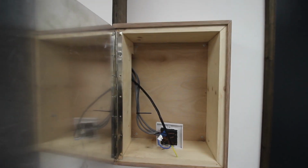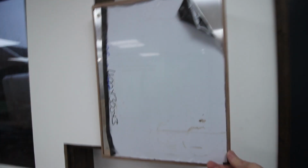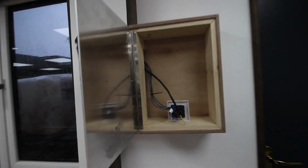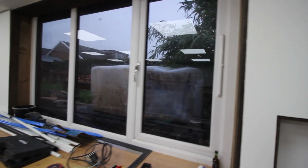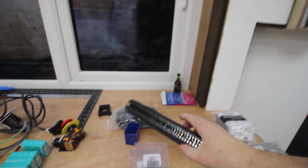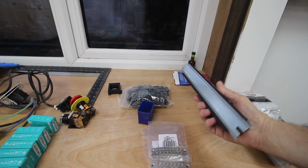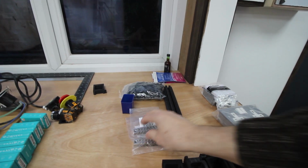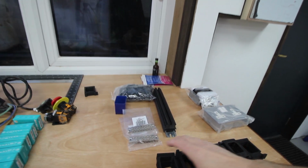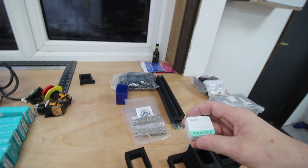Over here, this is the cabinet for the lighting and turning all sorts of bits and pieces off and on from in here. So that's underway. I've got a load of connection bus bars, DIN rail mounted. There's another packet of those should I need them. There's some earth strips, and these I'll just, I'll try and do this one-handed.